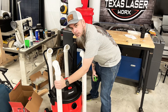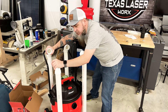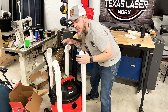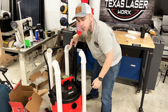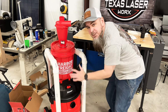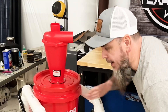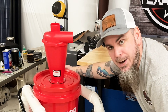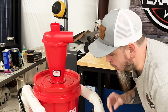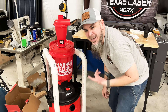Now that we've got our four risers, I have four elbows as well. We'll put two elbows facing each other on this side and two on the other side. We've got to measure and cut out a piece of pipe on each side. Once we have that cut out, I can measure my board so I know where the cyclone will sit on top. This is coming along fairly well, but I can't cut a perfectly straight square because the front part is wider than the back. So I'm going to take measurements and import them into LightBurn where I can cut out a perfect circle — I've got a big laser, why not use it?